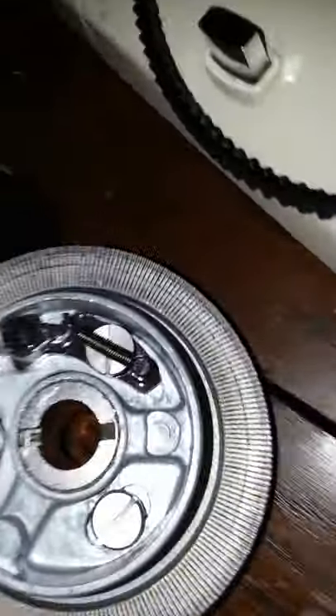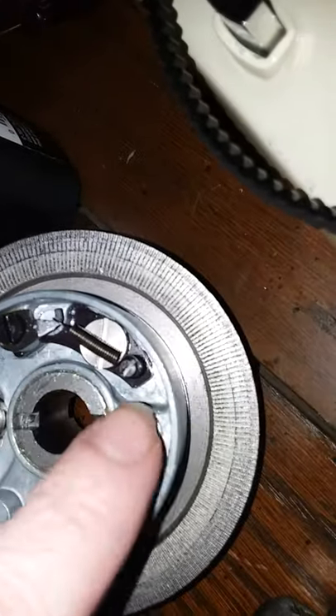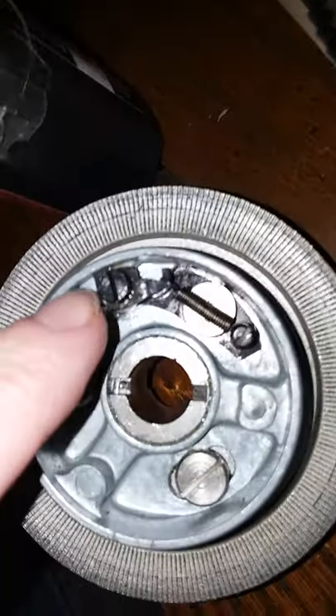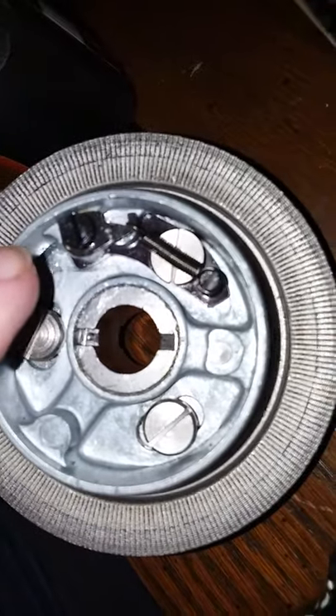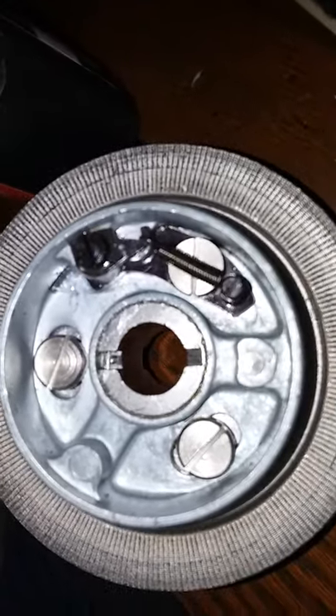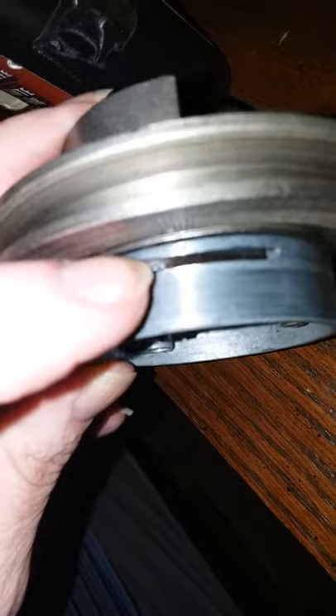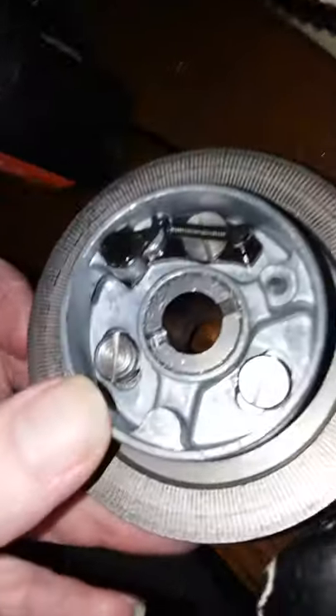This little part needs all the old oil and grease cleaned out from under it. It was a combination of crystallized sewing machine oil, but also bobbin winder tire debris. There's a lot of the bobbin winder tire debris that over the years gets into this area. I've cleaned it up quite a bit, but I'm still going to end up needing to disassemble this.